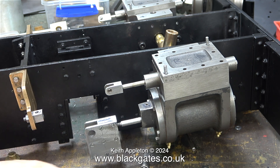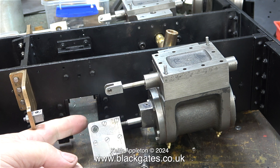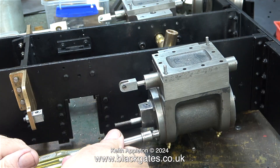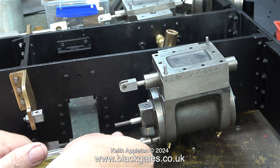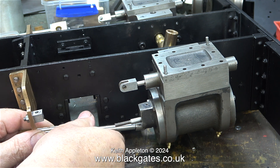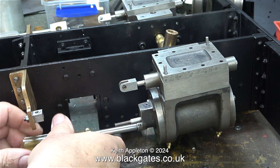In this part of the clip I'm removing the crosshead and it's not very tight on the thread — that's the reason I'm going to use Loctite 603. When the time comes to fit the crosshead in place permanently, well semi-permanently, you can always break the bond of Loctite products by using heat.